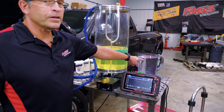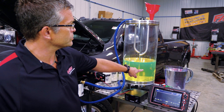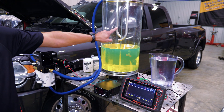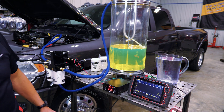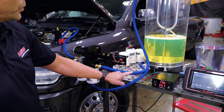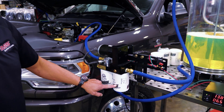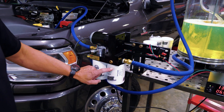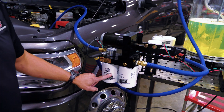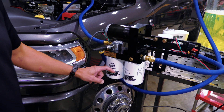I have approximately a gallon and a half of water right here with almost two gallons of fuel in here. You can see how clear it is. We're going to be pouring that water in here. I'm going to turn the power supply on now. We have a 10-amp fuse. We're sucking fuel in right here through the serviceable wire screen, stainless steel mesh up to the pump. This is where the air is separated out, but also this is where our extreme water separation capability takes place.